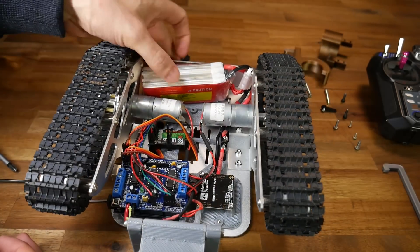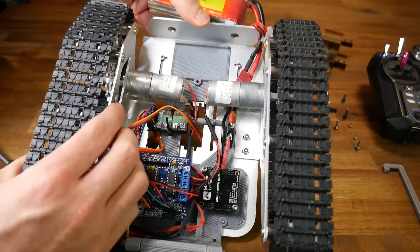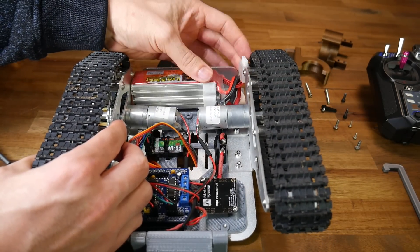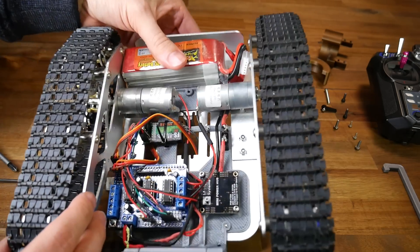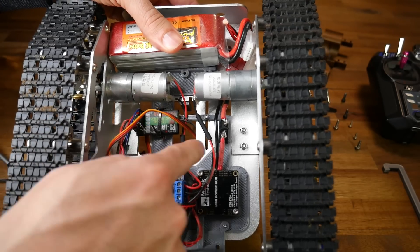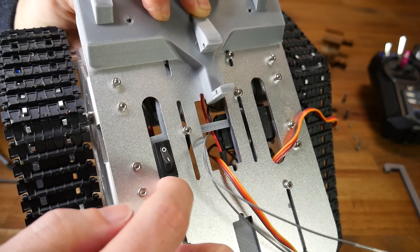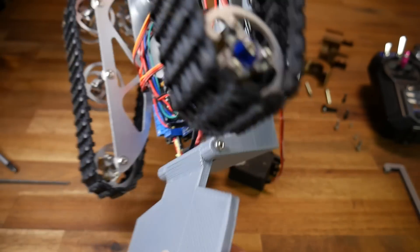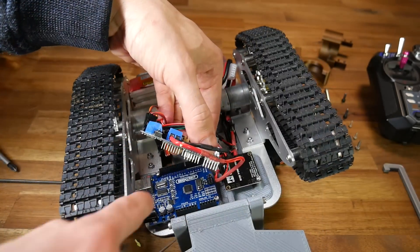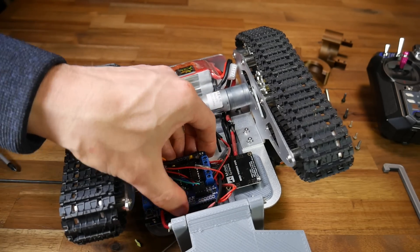Now it's time for assembly — it would have been too tedious to watch me put in all of these bolts, so I'll keep it brief. We have a tray for the battery up the top, and we need to place that and neatly wrap around the cabling as well as the charging port, to tuck it out of the way enough that it doesn't get caught but is easy to access later on. The receiver for the RC is simply cable tied in, and the switch — I'm pretty happy with the mounting for that, no bolts required. As you slide the plastic lower mount into place, there's a slot for it, and when everything is bolted up, it shouldn't be able to move. The Matec BEC needs a couple of bolts to go onto its mounting boss, and a couple of bolts also for the Uno underneath the motor driver shield.